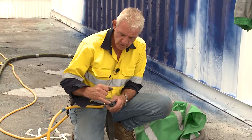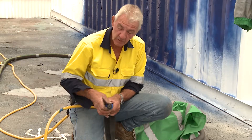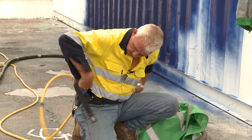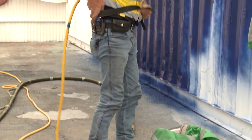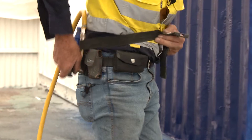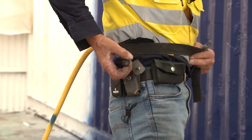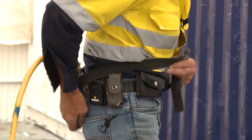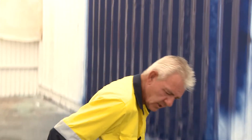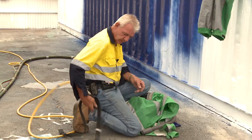If you have that open, we've got a small hole — what's the consequence? That'll get warm: small hole, a lot of air passing through it, becomes hotter. So the fatal mistake that people make — and I say fatal because it's actually quite dangerous — is if I attach this to my belt and wrap this around myself, a lot of guys have it pointing down, which is correct because the helmet attaches on the top. But as we blast during the course of the day, that'll move around, so you're actually pointing something that has the capacity to inject air into a very sensitive part of your body. If it's exhausting, it's hot, and when you bend down, you run the risk of injecting yourself with air. Is it possible? Absolutely. The air is not only hot — if it bumps against your leg — you also run the risk of injecting yourself.